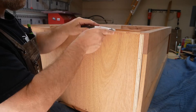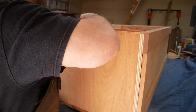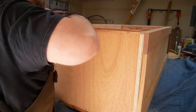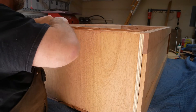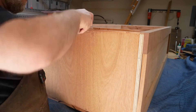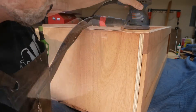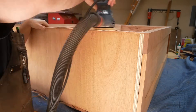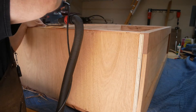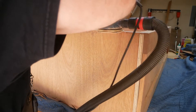Here's what I was talking about earlier — I'm using a straight knife to cut the excess Spanish cedar veneer off, and then I take the sander and sand it flush. I should have changed the razor blade out; that was a dull razor blade. And there it goes — it's basically flush.